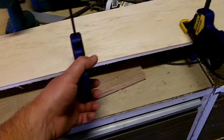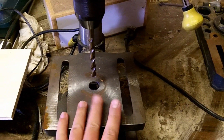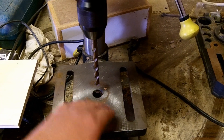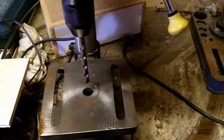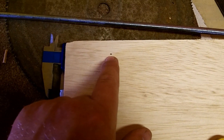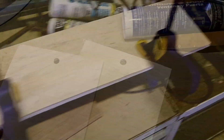I've just got some clamps here holding this together. And what I've got over here is a drill press — this is set up to zero the bottom plate so that we have a good straight hole when we drill through these pieces of plywood. This is a 9.5 millimeter drill bit, or 3/8 inch. You can see here I've got the holes from the template: that's the front axle, the center of the bottom bracket shell, and the rear axle point right there. So I'm going to go ahead and drill these out.